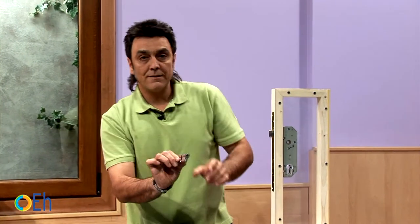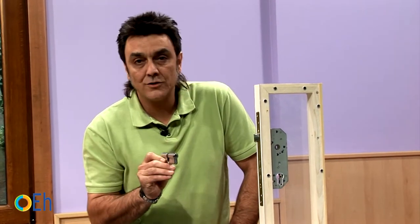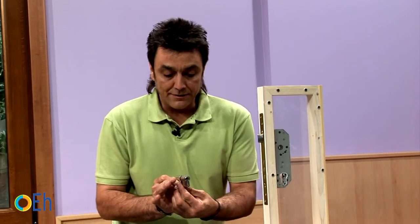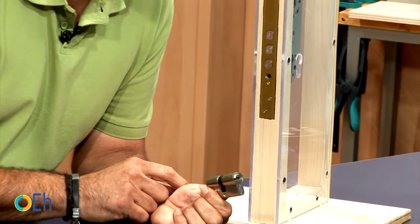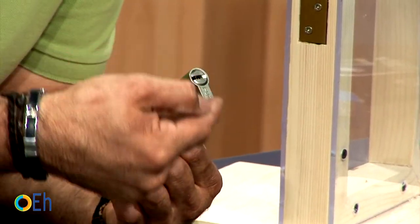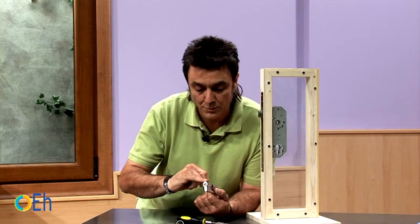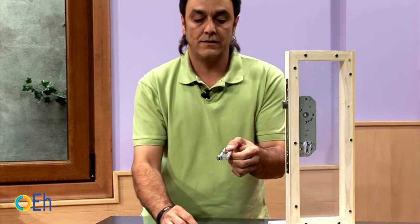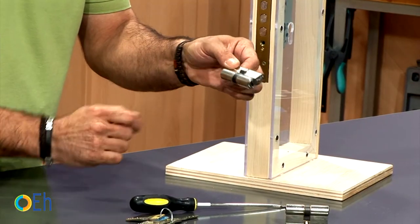On many occasions we are told that the screw is removed but no matter how much the cylinder is turned in one direction or the other, it does not come out. Eventually the lock is broken. If you look closely, the cam we saw before with the cylinder was centered right on the line of the cylinder, but in this model the cam is off-center, with a peak that remains on one side.